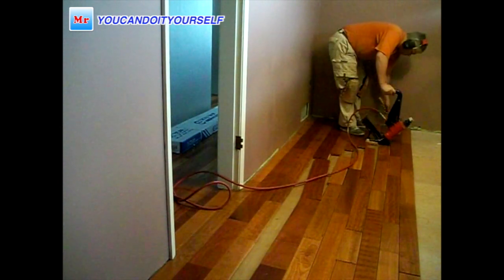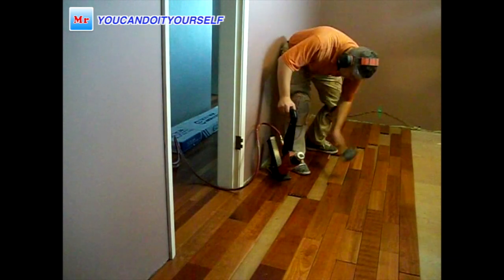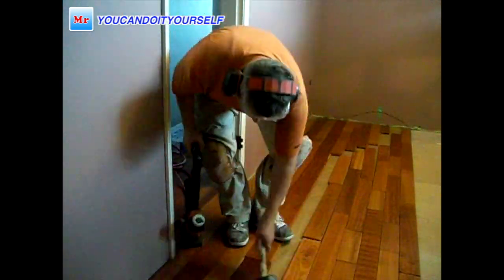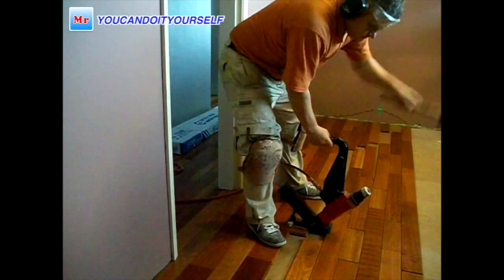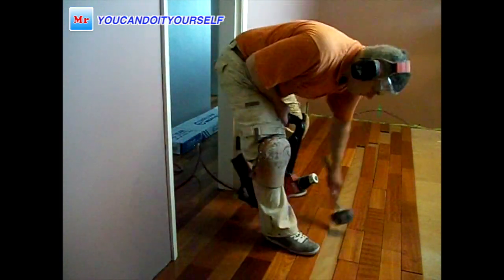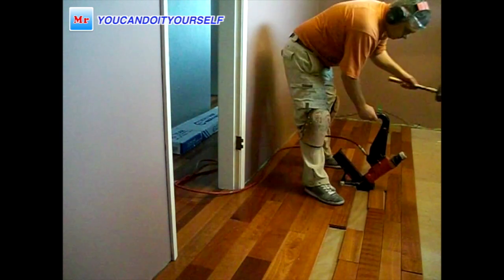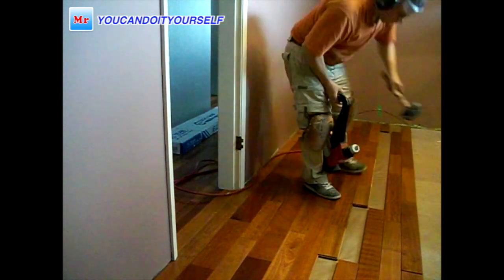In this video I just showed one way how to pass the door threshold with a flat transition. This is easy because the floor in the hallway and in the room run the same direction. But sometimes you need to deal with different directions — or put a board across, and you may need a reducer or riser because the floor levels differ. I'll put some links in the description because I have a few videos about how to do transitions, different directions, and nail-down floors. I'll also list what tools I'm using — maybe that will be valuable for you.